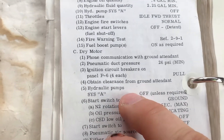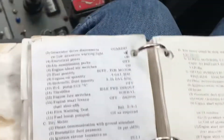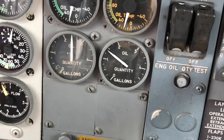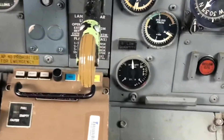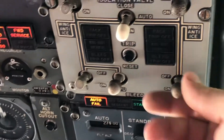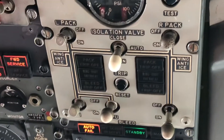We're not going to worry about hydraulic pumps — we're not going to turn those on. We need to keep an eye on a couple of main things. If we're going to motor engine two, we need to make sure we have enough oil available — I think 0.8 gallons is the minimum, so we're well above that. Hydraulic quantity, if we're going to operate our hydraulic pumps, needs to be above 2.25. We need to have our start valve pushed in for this operation, so I'll go ahead and close that circuit breaker. And if we want to motor engine two, we need to have the bleed valve open for engine two to allow pneumatic air to it.